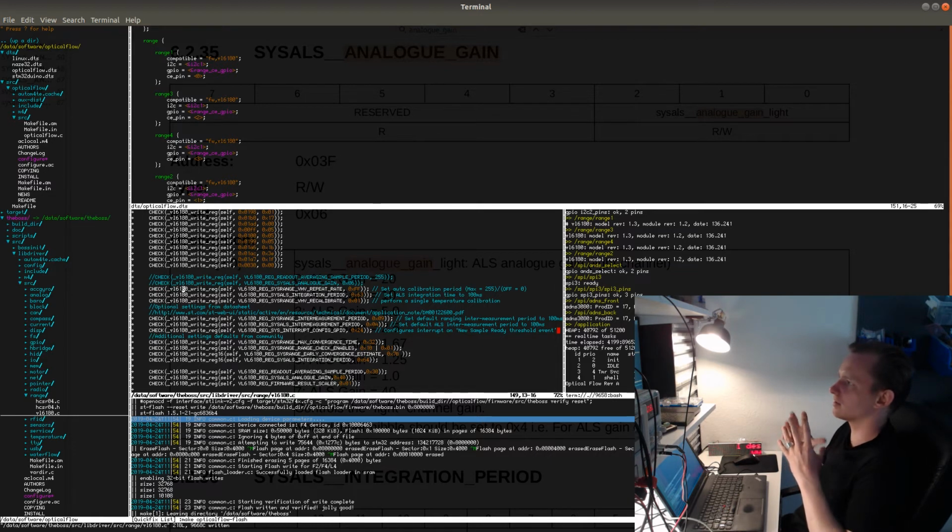In terms of precise microsecond delays, I use the DWT counter. This is the debug macrocell counter, which counts clock cycles. So it's actually possible to have a very precise delay function that measures by clock cycles. But that, on the other hand, also puts the CPU under 100% CPU usage. To get this perfect microsecond delay, you have to disable the scheduler. Because otherwise you can have your task swapped out while it's in the middle of the delay, and then the whole point of actually having a precise microsecond delay completely disappears. So I don't use sub-millisecond delays very much, precisely because of these implications.